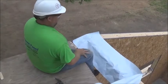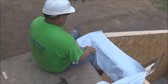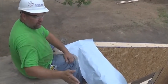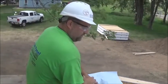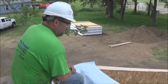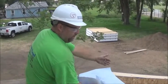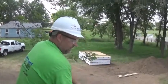Today we're back on the habitat site. We have set in our load-bearing wall and our ridge beam. It's only a 24-foot wide home, so at the center we made a load-bearing wall to separate the rooms. Now we want to demonstrate putting down the SIP tape — this is a very important detail because it takes care of moisture trying to get out of the building from the inside, or anything trying to come from the outside in.